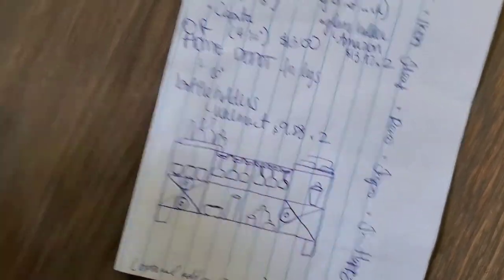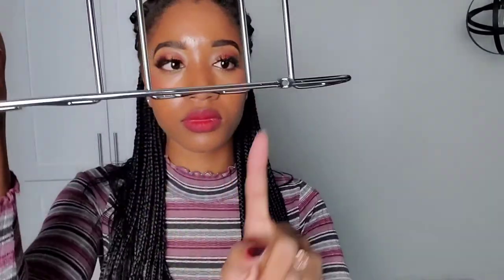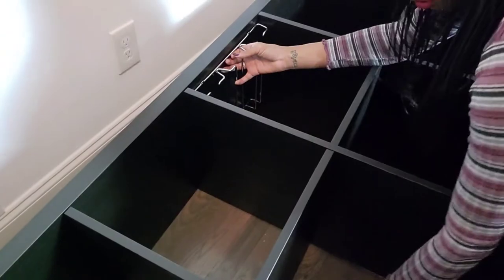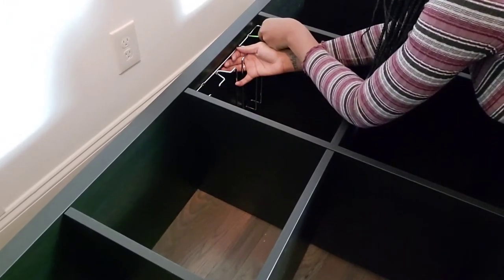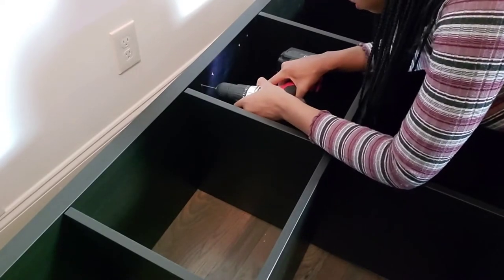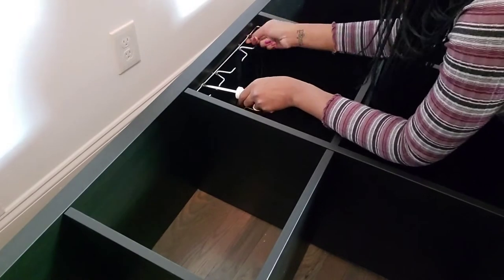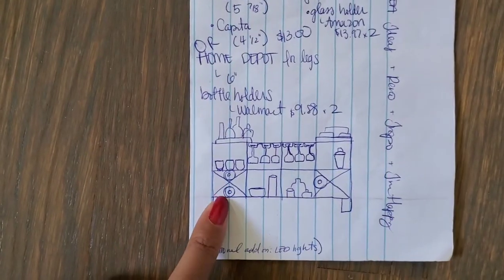Returning to my drawing, I wanted two of the shelves to have wine glass holders. I got these wine glass racks on Amazon for $13.97 each. Each rack has four holes, and that's where you need to make holes in your shelf to attach them. The way I marked the spots: I dipped the end of a paintbrush into some yellow paint and stuck it through the holes, leaving a little yellow dot on the shelf where I needed to drill. You'll notice there are four holes on that top row instead of two — that's because the first time I put the rack on I put it on backwards. Please learn from my mistakes: the front is the side with the little hill shapes.